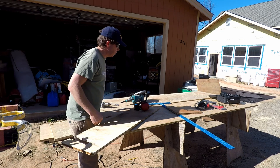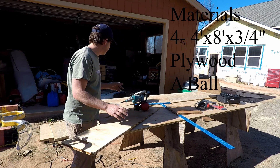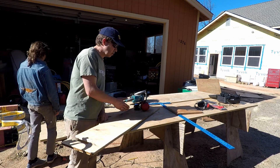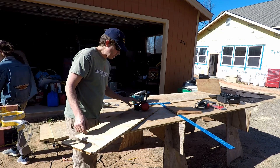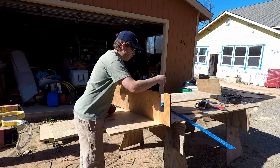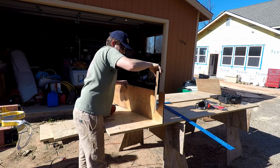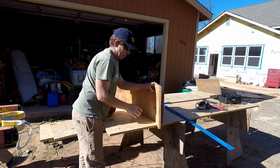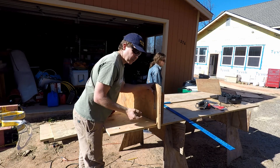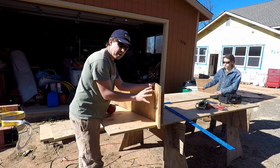What we've got already — I started this a little late — but I've got four pieces of three-quarter-inch plywood that are four by eight. We've cut those in half and those are going to be the walls of our court. Now we have to make notches in the edges that will line up so they all interlock together. We want this angle to be 45 degrees so they all make a nice octagon.